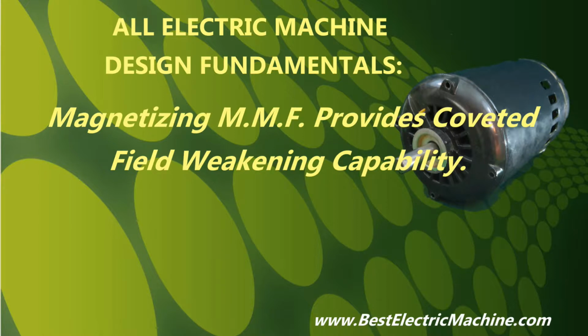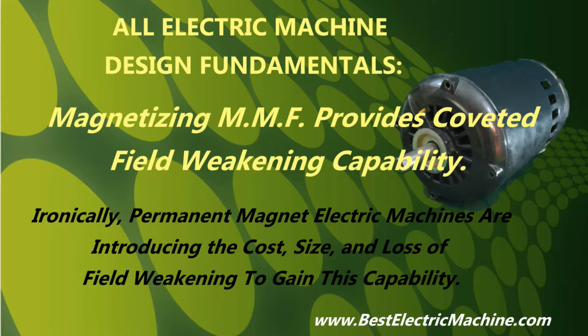To leverage the attributes of field weakening, some permanent magnet electric machine systems ironically incorporate magnetizing MMF with all the associated loss, cost, and size that were the original argument for migrating to permanent magnet motors in the first place.